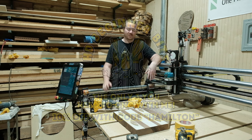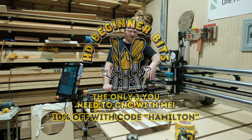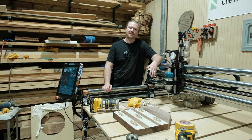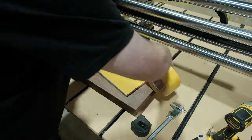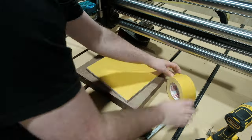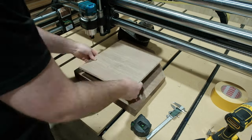In all this hustle, I forgot to mention the bit we're using — the Downtown Jenny, which is one of the only three bits that you need to CNC with me. All of the toolpath databases as well as our feeds and speeds are available on cncwithme.com. After I cut all those out, everything worked out just as planned with all the double-sided tape, so I didn't do any type of tabs and we're not having to route those out later.